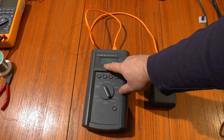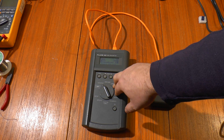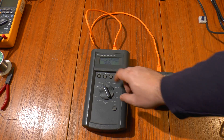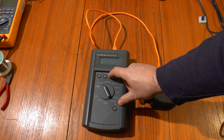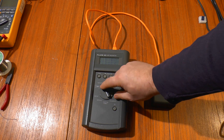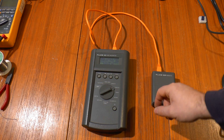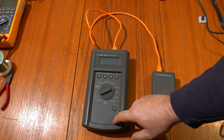It was only doing a 10BASE-T Cat5 connection, but this unit is the best part of 20 years old — it was about £1,800 when we bought it plus VAT. Initially it was used mainly for doing the BNC checks, because as you can see it's got token ring, Cat3/4/5, RG58, RG58 foam, 10BASE-2 which is the old thin ethernet coax, and RG59. So you can see it's got all sorts of stuff in there.